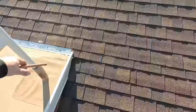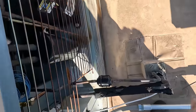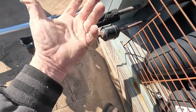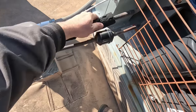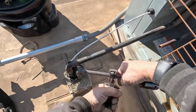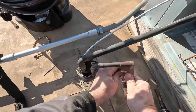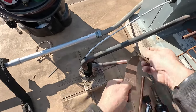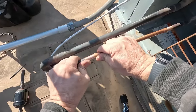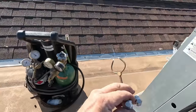You can see this goober here — that doesn't belong up here. That looks like it's three-eighths and somebody squeezed a half-inch thing down, and that could have been causing issues too. Unfortunately it looks like there's a lot of work been done on this line set. I've got a little sandpaper here — we'll sand it up, move it down, and put some nitrogen through it again and get this thing brazed in. I don't know why they didn't put it downstairs where it belonged.